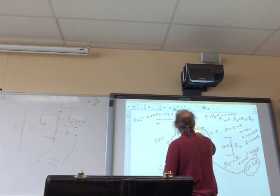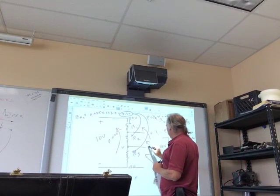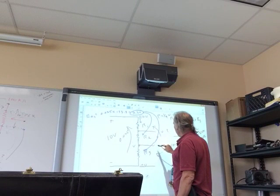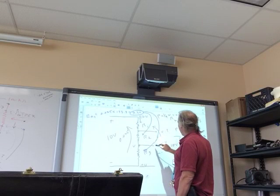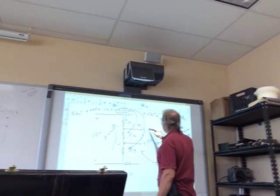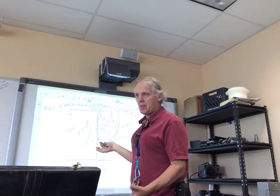And that's true for each of these. Now we're rounding, so it's not going to be quite right. Okay, I know at this point right here my voltage is 3.3 volts. What's my voltage right up here? Well, it's 3.3 plus 3.3, so this voltage right here is going to be 6.6 volts, right? And then it would be 9.9, so we'll say 10 volts, because we rounded.